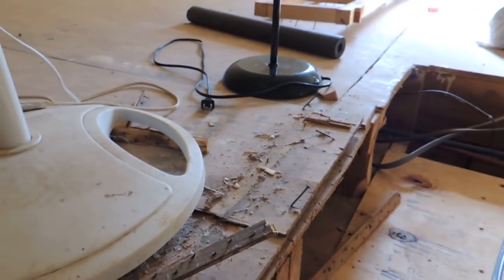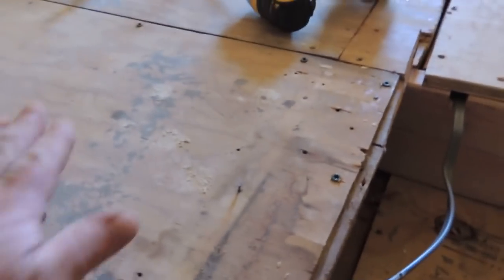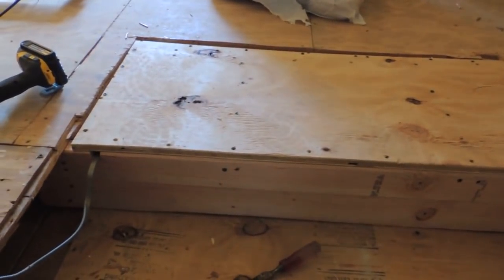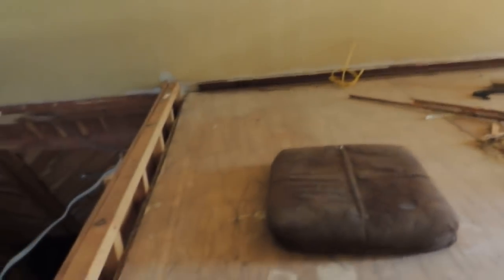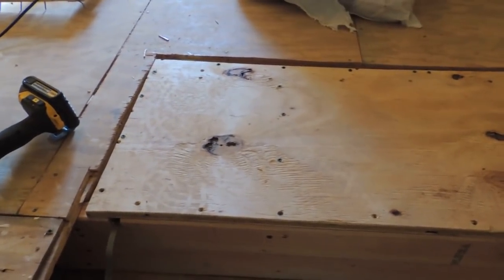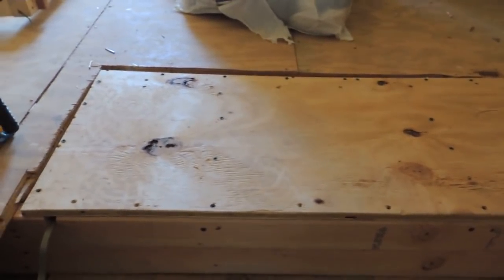I've got all the carpet tack pulled up and repaired the floor — this will be covered. I had pulled it up before and it's all back down now. Got that top step all fixed. I'm going to run a channel for this electric — I got that notched in there. We're gonna get these rails up today, at least this one and this short one here. I'm using pieces of plywood that I built the landings out of, and they won't fit perfect, but I'll probably do carpet up here with pad and all that.